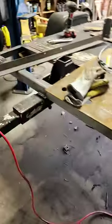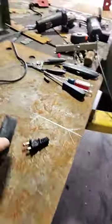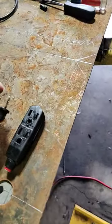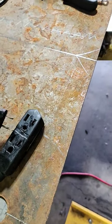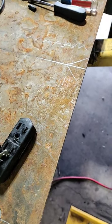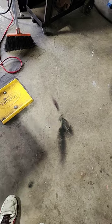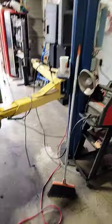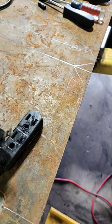Yesterday, I had a situation where I was using this extension cord with this end on it. It has multiple plug-ins, and this was a grinder that I had plugged in. The whole thing went to heck in a handbasket because when I was grinding and cutting, I was getting a lot of filings into the plug, and it basically had a little arc flash situation going on on the floor last night. So I ran over and unplugged it from the wall, and then this morning I got to put in new ends on my cord and my grinder.